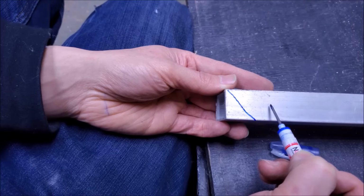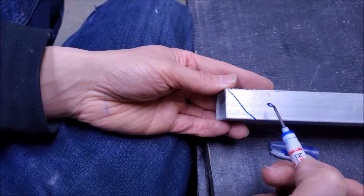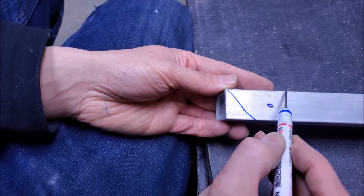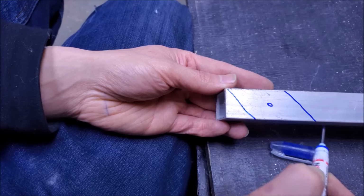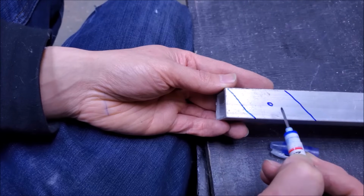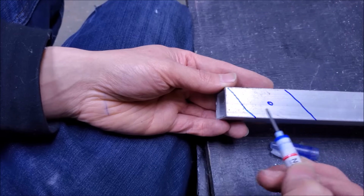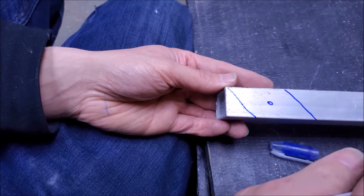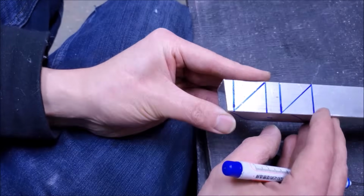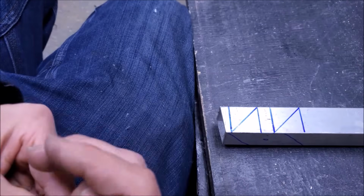We need to keep some room, so that way we can put a screw or something in there to mount this portion of the optical mount. And then over here we need to make another cut at a 45-degree angle. So laser comes in this way, goes past our mounting point right there, hits this other mirror and out the front like this. Now our marks are going to need to be a lot cleaner and better measured than this, and luckily I've already taken the time to do that on this side. So go ahead, put this in the vise and start our cuts.